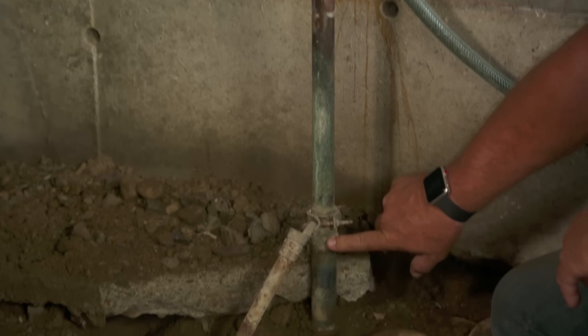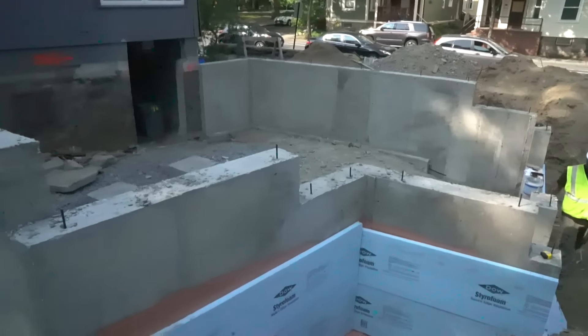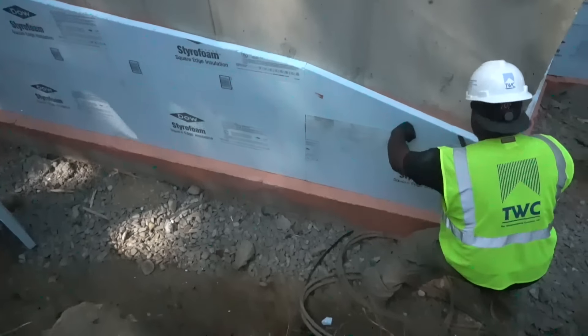This looks much better — now we're in a beautiful pipe. So beyond the tree roots, it's in great shape, it looks like. This is what we like to see. There's the drop-in of the sewer — this is our city's sewer. So we've proven that the majority of this line is in good shape, and we'll give this to the town to review. But we found rocks early, we found a break at 10 or 12 feet, and we found tree roots. This water main is copper, and this looks to be galvanized steel pipe — a metal pipe that rusts that needs to be replaced. It probably makes as much sense for us to dig the front yard to that 12 feet, get rid of that break, and have a new water main. Good job, Charlie.